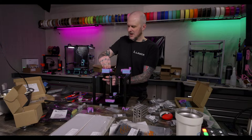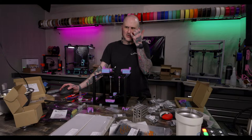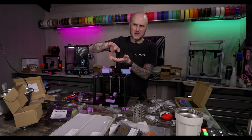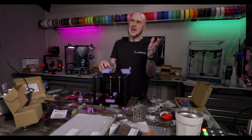I don't think a higher wattage heater would make much of a difference. Higher wattage heat doesn't increase flow. Just throwing a hotter heater element in doesn't really increase flow. It will help if your flow rate is high enough that plastic is moving through so quickly. It's like pouring water on something. If you drip water on a hot stone, it's going to cool off a lot slower than if you dump a bucket on it. So if you're flowing a lot of filament, you're going to be wicking the heat away. So you need a hotter element then, but that's not really a limitation of the heater element. Too small of a heater element will hurt flow. Too big of a heater element won't improve flow. Best way I could probably put it.